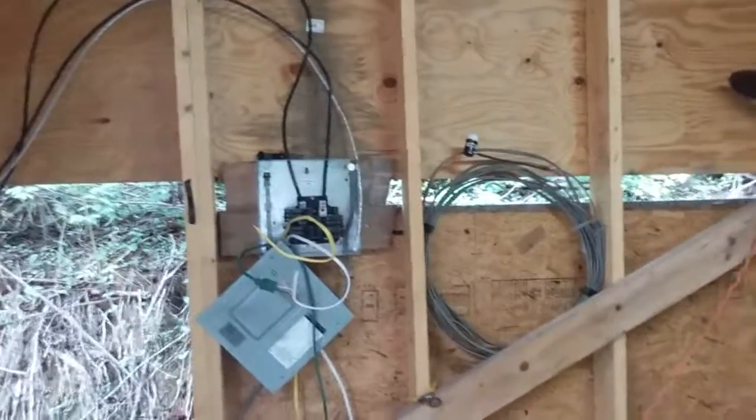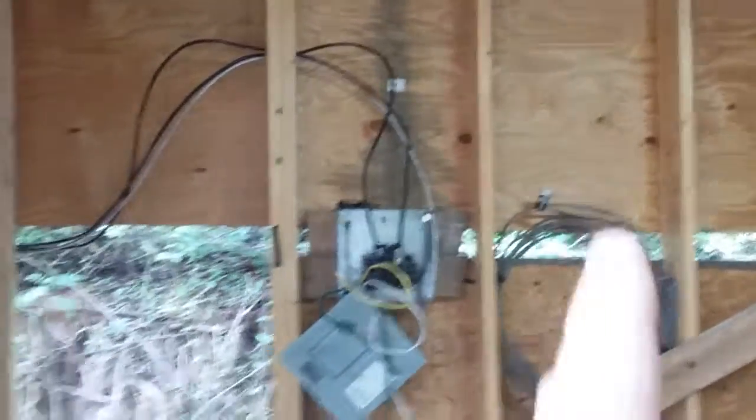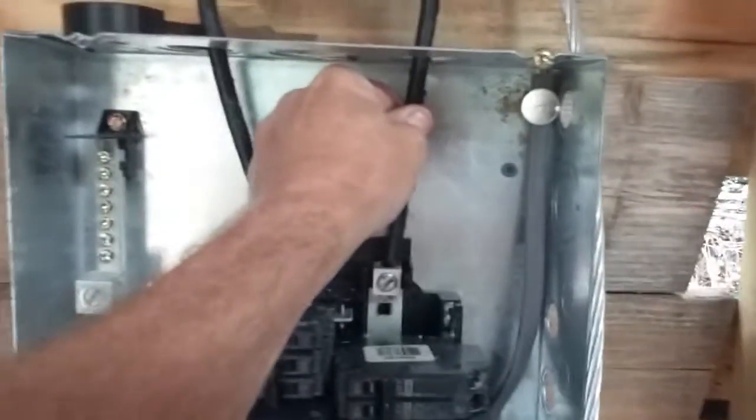June 2017 at the building. Today I'm doing some electrical work — this 125 amp service that I'm getting mounted in. Right now I'm putting the hot wires in and tightening that bug nut down. The black hot wires are tight, white neutral tightened up, and I'll put the ground in here in a minute. Then we'll hook up the 125 amp service to the 200 amp service.